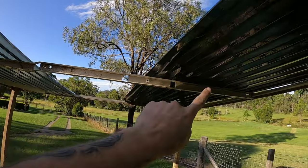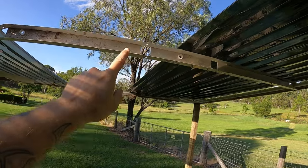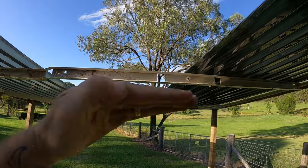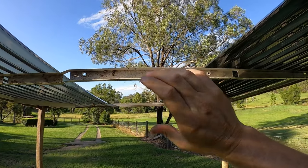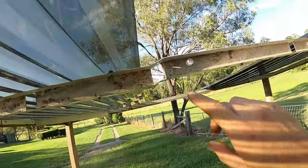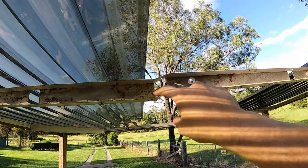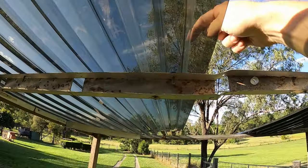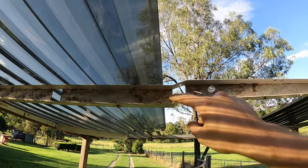Because this is old aluminium off the caravan, it had a heap of holes in it already since it was used as a horizontal beam the other way — so right now I've got it turned up on its side. It's lost all its structural integrity because of these nooks. I was pushing down on it to screw it in and it's just bent, and I can see now it's actually snapped there as well. So I'm going to have to unscrew it, find another piece, and cut it to size to get that sorted.